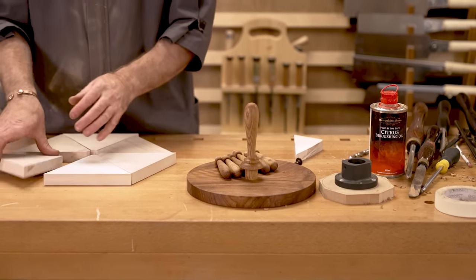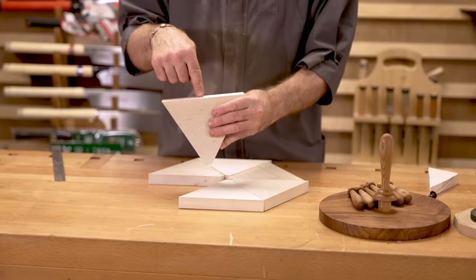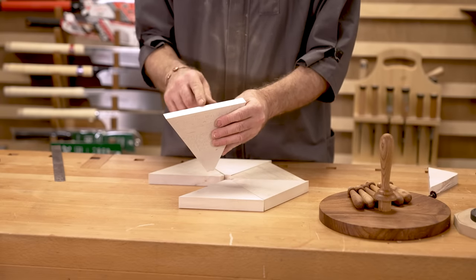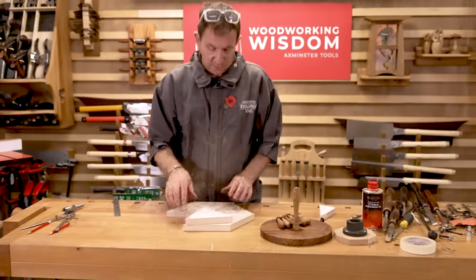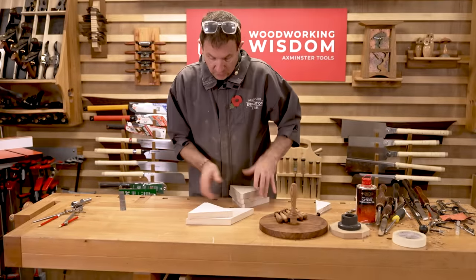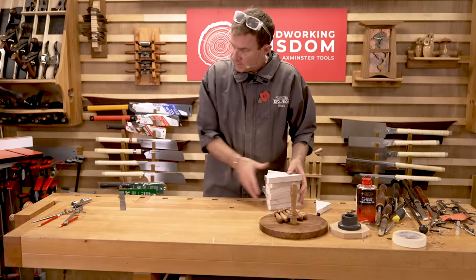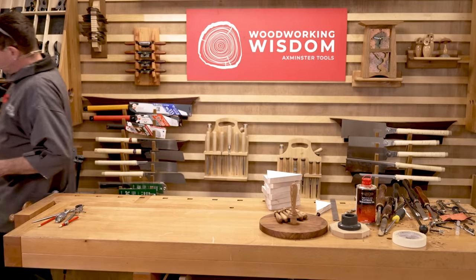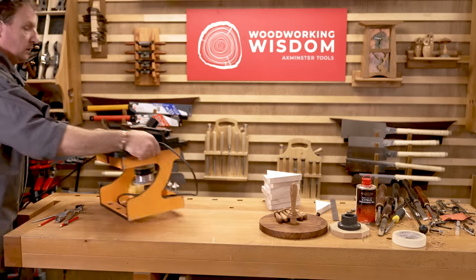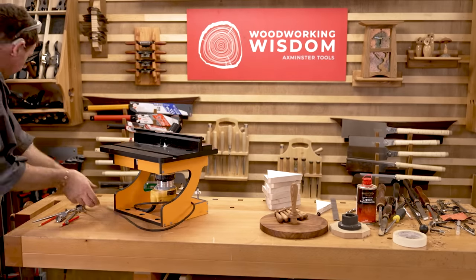Next thing I want to do with these, put a moulded edge on so they look a bit more decorative, and then we can drill them. By working that way we get a cleaner drill hole, so if I do the moulding first then drill it, we're going to get a better finish. So let's have a quick tidy up, move those, just create a little bit of room. My drill pile is going down, which is good. Let's get the little router table. So, small router table, ideal for this.